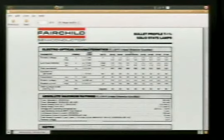If there's anything at all you want to look at in a data sheet, the most important part is your forward voltage. This right here is telling you what you need to know. Like in our example circuit for our Hello World, our LED was running at 2 volts at 20 milliamps. How did I know that? How do you figure that out? Where's the magic? This is the magic. You go to the data sheet, and it lets you know what all this stuff is.